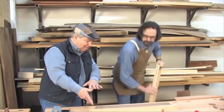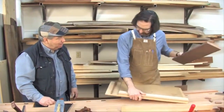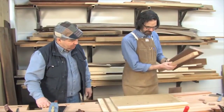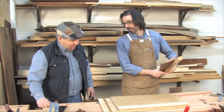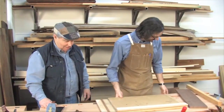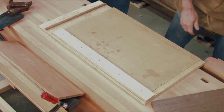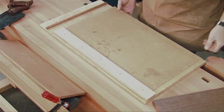What about the ends and the edges? I've got two other redneck jigs for that. This one's a little fancier — it's MDF and plywood. What we've got here is my end-grain shooting board, and it's also a sawing bench hook. I'll take a piece of wood, saw it off to the right length on the bench hook side, and then quickly flip it over and plane the end.